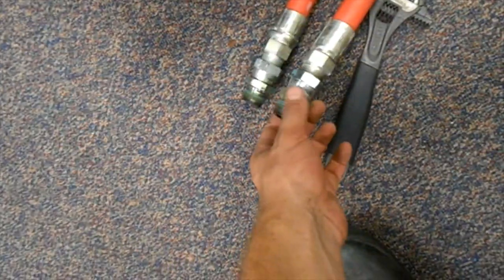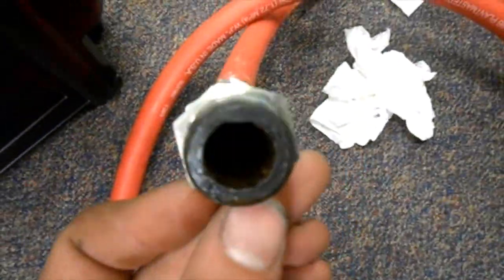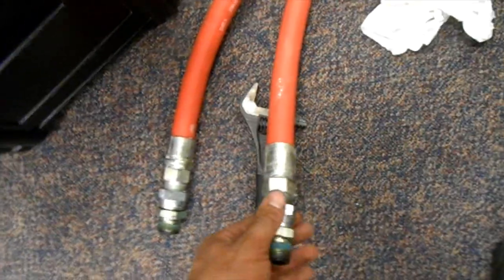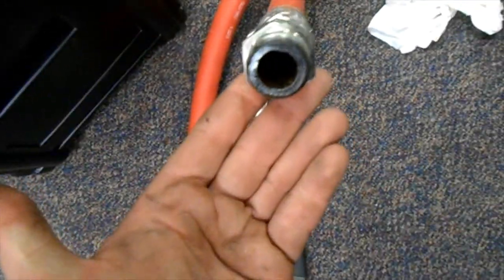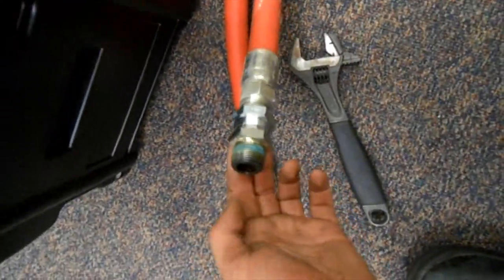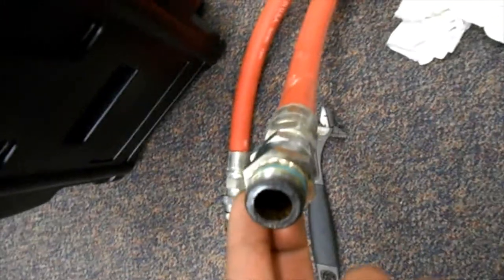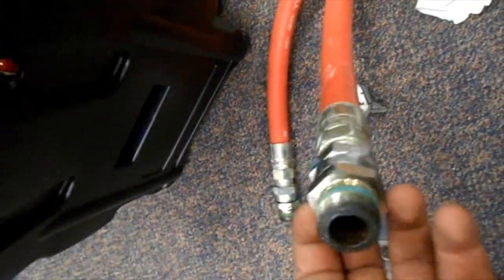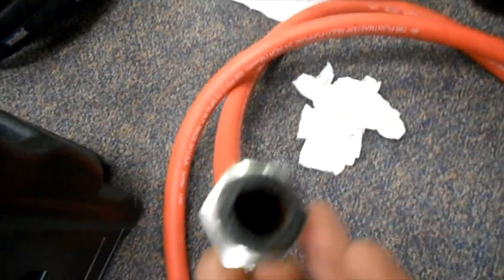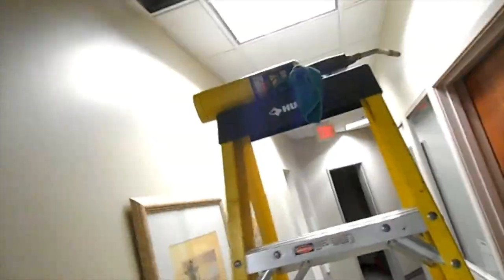More in a bit. Okay, my friends, we got our hose ends off of there. Pain in the ass. These parts were threaded into the copper. You can see this electrolysis. No good. We might save those and use them somewhere else. You just gotta use a dielectric union in between them or brass something. Can't just screw them right in the copper. I went to unbraze one of the fittings that was up there. And once I got the heat on it, this pipe dope melted or whatever. I guess it's kind of like a glue. But it unthreaded, so I saved myself a little work there.